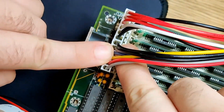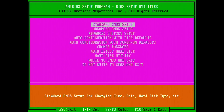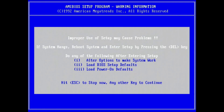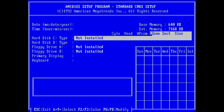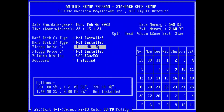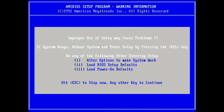Let's see if we can get this board to boot. We get a beep — that is a very good sign. The first boot after at least 20 years. Let's enter the BIOS and see what we can find there. Let's change the colors before we do anything else — old BIOS screens need to have a blue background. Now that the correct color scheme is set, we can proceed to change the date, add a floppy disk for drive A, and explore other options available in this BIOS.